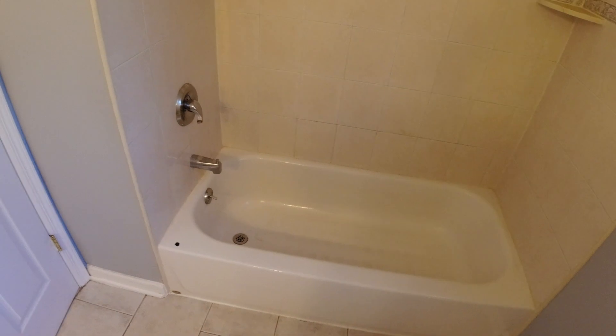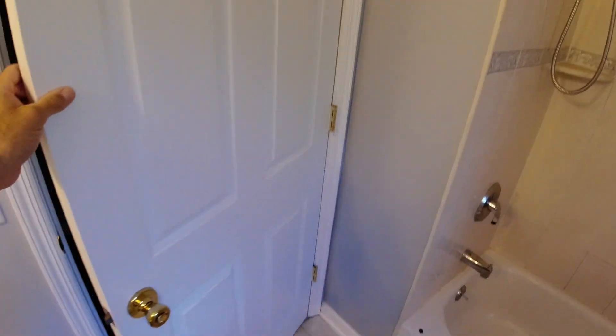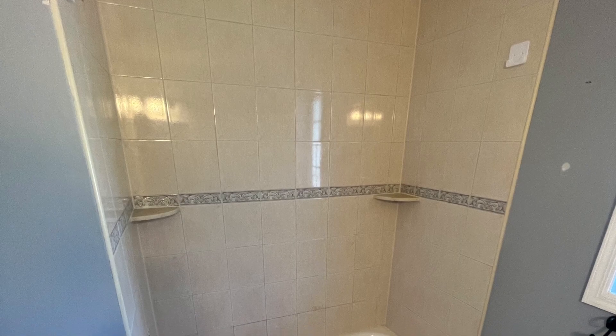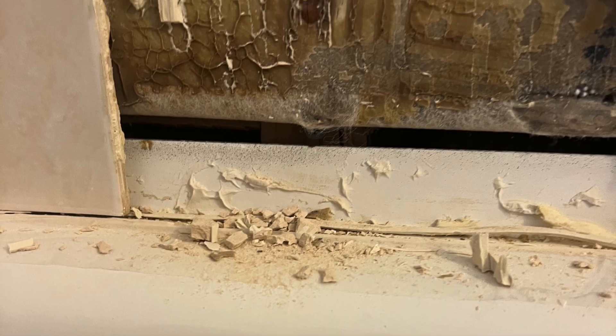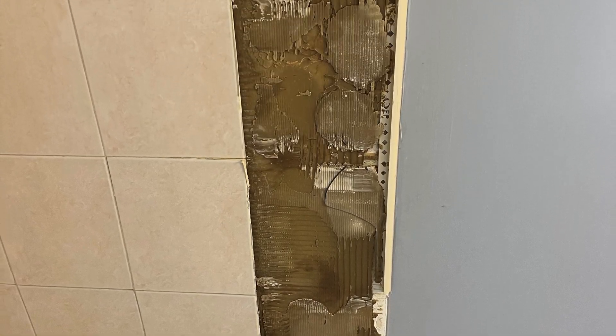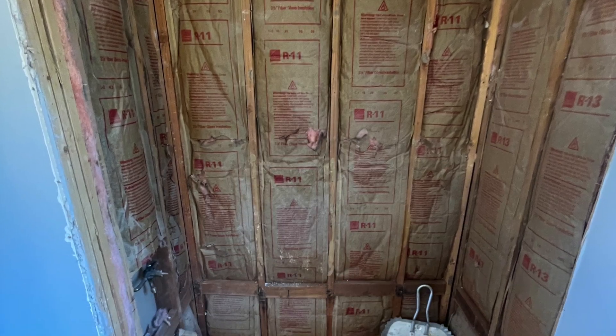I'm going to walk you through the whole process of this job, show you some pictures and clips, and tell you what it took, the time it took, and what I charged the client at the time — which was in July of 2022 in the central New Jersey area. This is a 20-year-old bathroom, everything original, having issues — no waterproofing and so on. Look at that gap there, that's just asking for water to get through. They set the tile with mastic, which is wrong in a wet area, and they also spot bonded — completely wrong.